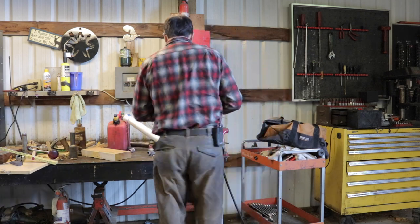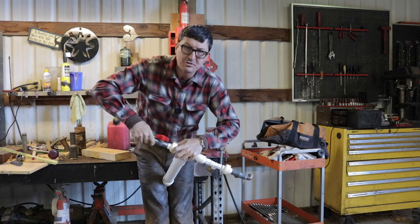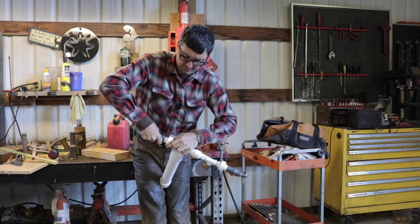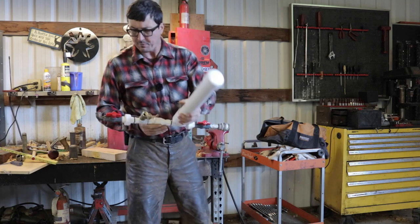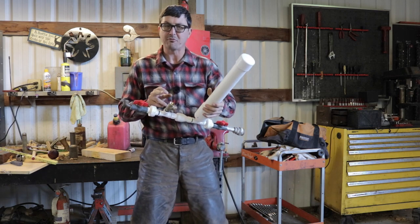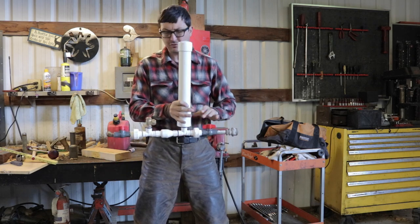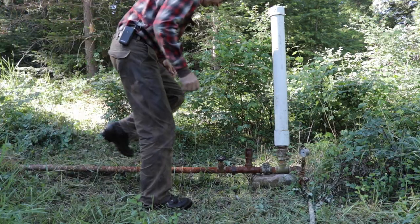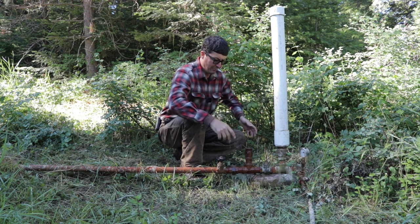I think we're all ready to go down there. Before we go, I wanted to fire up the old ram pump and measure how much it's flowing — how long does it take to fill a gallon? Then we can do a comparison with the little half-incher to see how much it flows per gallon. I like the idea: if this pumps enough water for me, it would be better because maintenance costs are going to be less. Replacing these check valves will be a fraction of the big ones, and it may just be enough. We'll see. It's probably going to be quieter, so I'll be interested to see how it performs.